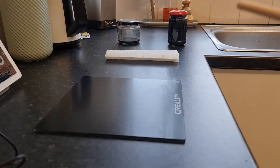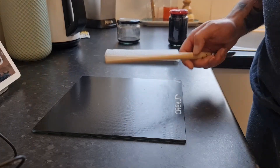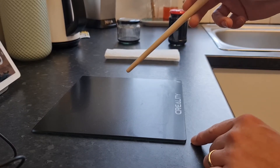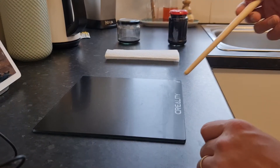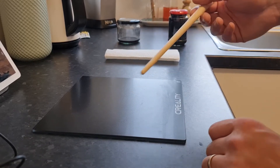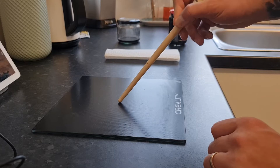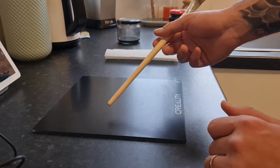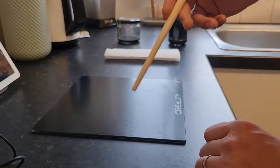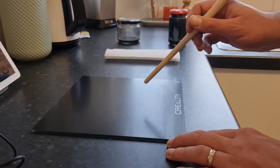Let me just point this out before I start applying the thin layer of ABS juice. From my personal experience, I think it's better if you apply it cold. This whole process for me — until I start the next print — takes me about 10 to 15 minutes. After I wash the glass to degrease it with water and dish soap, I dry the glass base and I apply it straight after that. I apply it while cold, then you can just put it straight on your 3D printer and get the bed to start warming up. For me, nothing changes — it just leaves that very smooth finish, which you'll be able to see now.